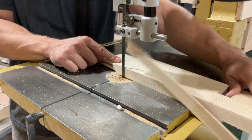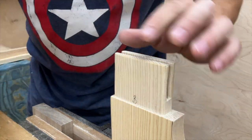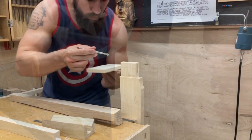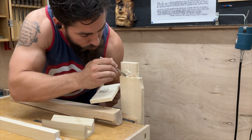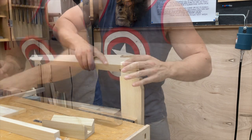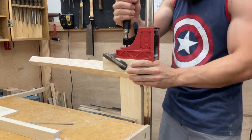I'm adding some light curvature to the aprons to match the curvature of the leg. I'm also treating the ends of those tenons to give them a little bit of flare as they poke through the outside of the leg. The glue-up on this was honestly quite simple because you're gluing up one leg at a time — there's nothing connecting each leg that makes it imperative to glue everything simultaneously. Gluing up one joint at a time, making clamping cauls that span over the protruding tenons — it was a pretty simple glue-up.